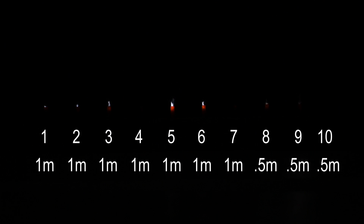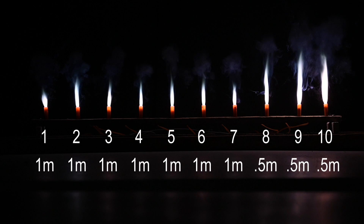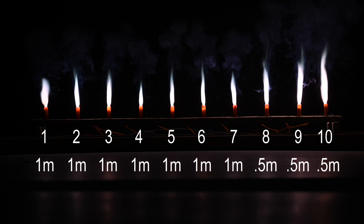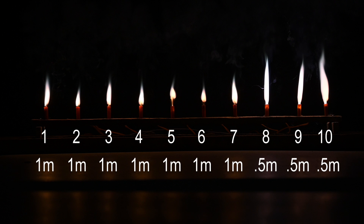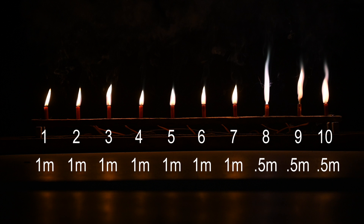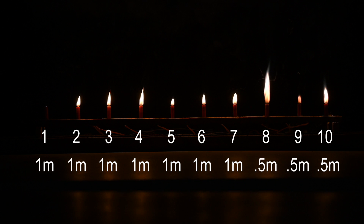That was obviously quite quick, so let's look at this in slow motion. I'm adding a caption to show what the original igniter wire lengths were, as it's possible that each different length was a different batch — this will help to see if differences are per batch or just per igniter. Igniters one to seven in this first test were from a one-metre batch, and eight, nine, and ten were from 50-centimetre batches. The three on the right from the 50-centimetre batch all seem to have a significantly bigger flame than the other seven.